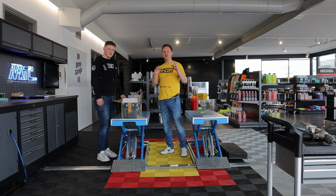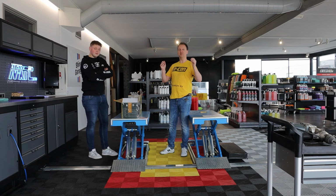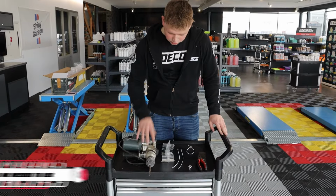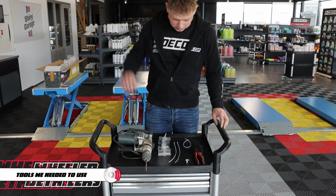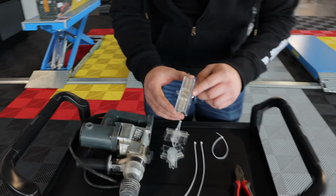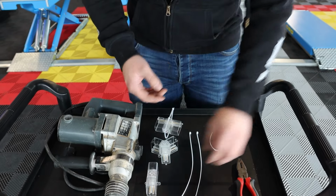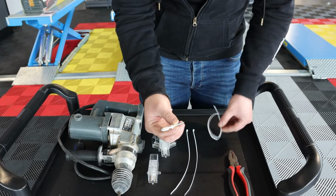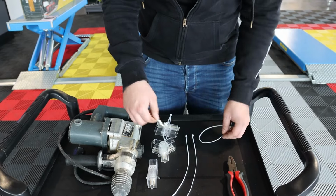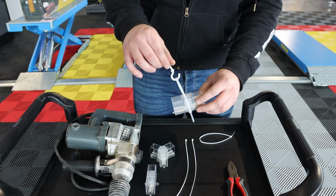So once you have determined how you can mount the Hexagon lighting to your ceiling, do you also want to have it hanging? It can also be done in separate ways. With this ceiling, we are going to use a drill to drill into the ceiling. But you can also use these connectors. They have holes inside, so if you have a wooden ceiling, you can drill it right into the ceiling. In our case, we use these hooks and we hang them with the tie wraps. As you see, with this connector you could just hang it. Easy as that.